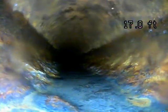When you have the line cleaned, I would recommend having it hydro-jetted as opposed to having it snaked. A snake or a cable is good for punching a hole when you have a blockage, can drain everything, but it doesn't do a great job of always getting everything out. With a hydrojet, they'll blast everything out with high pressure water, and then oftentimes it includes a camera scope as well, so you'd be able to see that it was all cleaned out, but also with this line you want to see the rest of the line to see if there's any bigger concerns.